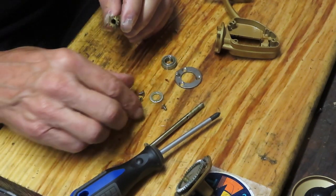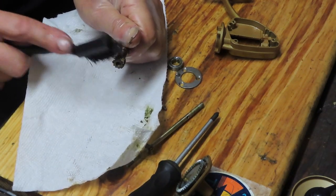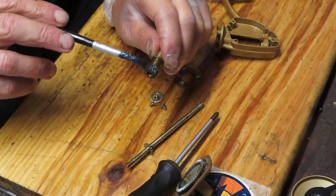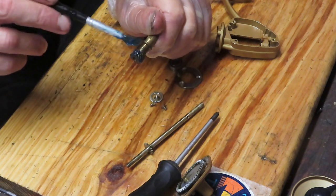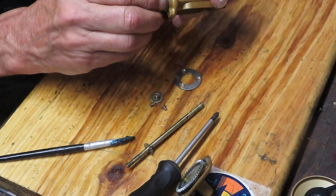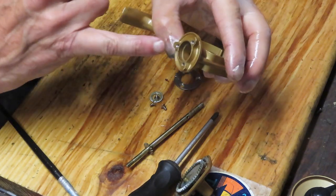While we have this out, clean it up. There's some old grease accumulated on the bottom of the pinion gear shaft — wipe it off or scrape it off. Use a razor knife for that, but please be careful. Then take a hard brush through the channels where the pinion gear teeth are to knock off any remaining grease. This reel appears unused, so what's happened is the grease has simply evaporated and dried. I'll use Penn Precision reel grease to reload it.